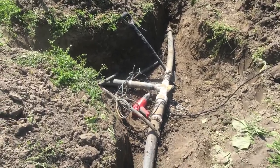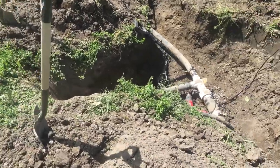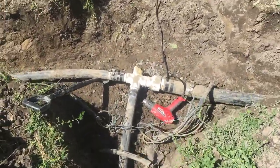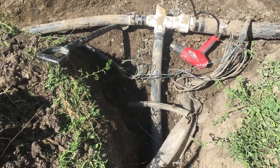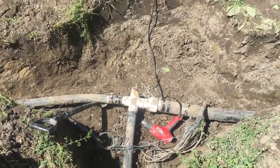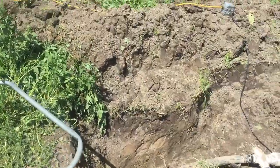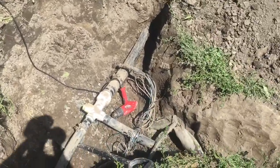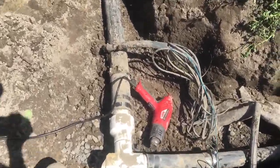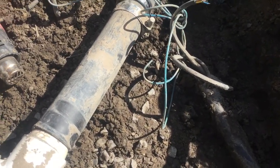So we're going to redesign it a little bit, but right now we're out here in the middle of the field and getting these fittings apart takes heat to soften the pipe. You can do it with a propane torch, but if you have a heat gun it's a lot safer and more precise. As you can see, there's a heat gun sitting down there on low setting.